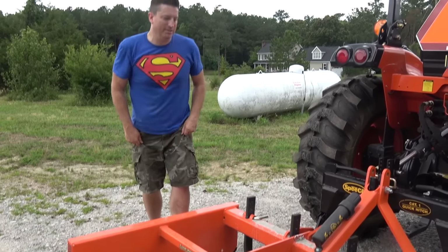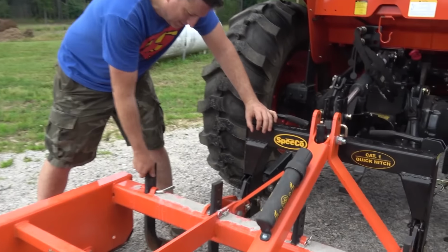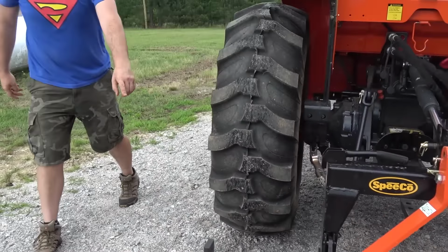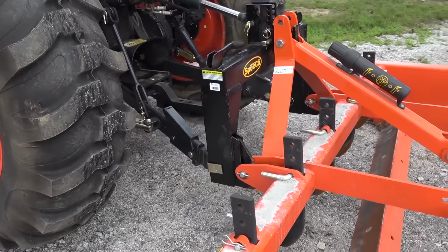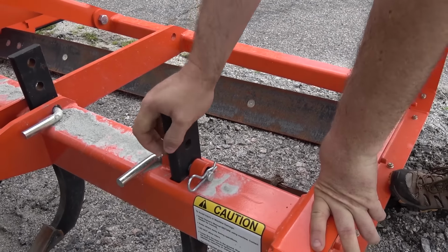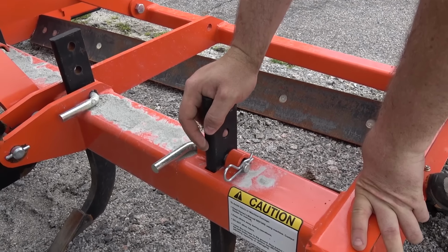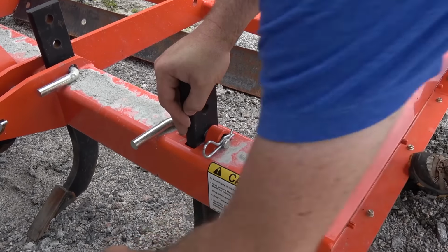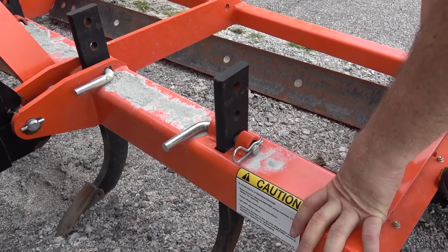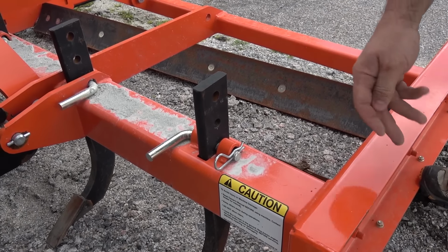And how it works is there's sort of 3 parts to it. These things are called scarifiers. Hopi, can you swing around the front so they can see it from that angle? We're not going to use these much today, but their purpose is to break up hardened soil and stuff. This stuff will break up just by dragging on it, so I'm not going to set these deep. But that's what they're for, like new land that you're just breaking.